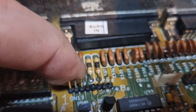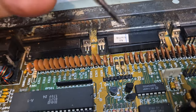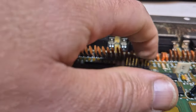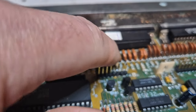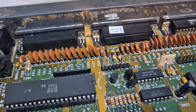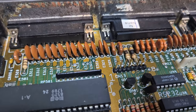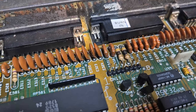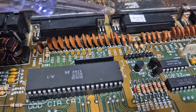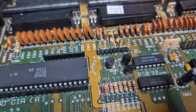What do I see here - some charred components. Are they gone? They might be okay, it might just be a bit of heat. I'm just going to check with a multimeter for the value on these and see if they're okay. That's not unusual - especially with monitors, you find resistors that have heated up slightly over time, or from misconnecting something. It's near the serial port area, so it might be somebody just plugged in something they shouldn't have.